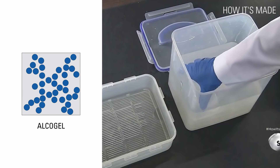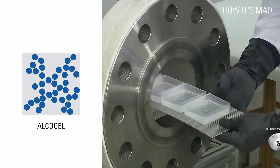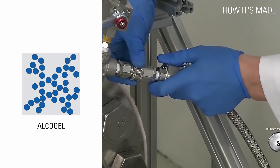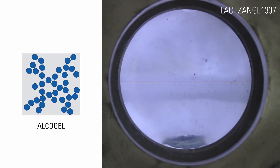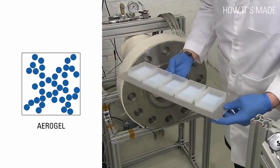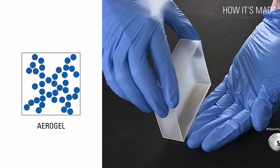The gel forms soak in methanol for several days to form an alco-gel. Methanol displaces all the water in the pores and flushes out any impurities. In the final stage, the alco-gel is placed in a pressure vessel where the pressure can reach 100 times atmospheric pressure. Liquid carbon dioxide is pumped in and heated to the supercritical point where it can either be a gas or a liquid. The carbon dioxide extracts the methanol in the pores and slowly dries out the gel. Conventional evaporation would have caused the solid silica to collapse. This final stage converts the alco-gel into aerogel.